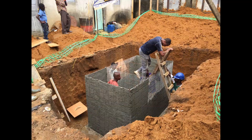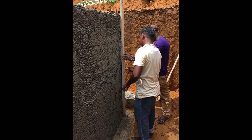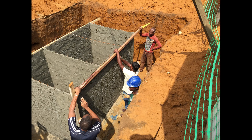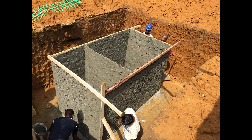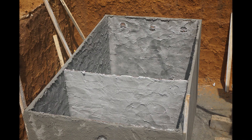In this fashion, the entire inside surface is covered. A wooden frame is installed to keep the walls straight and true as the mortar sets up overnight. The next day, the outside walls are mortared and smoothed. The wooden frame is removed and a thin scratch coat is applied to the inside, which is what keeps the tank watertight.